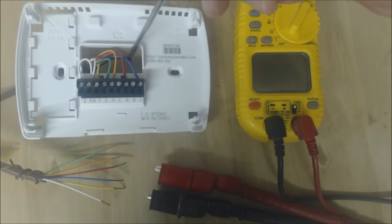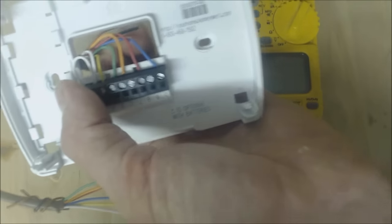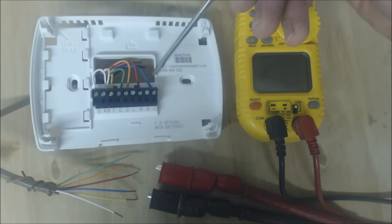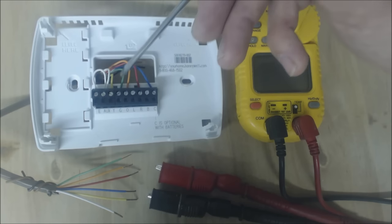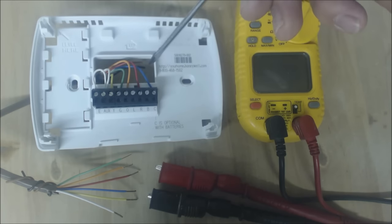You should have an additional two wires — typically you use 18-8 wire for something like this, and you could use wire with even more conductors if you have an outdoor temperature sensor. You always want to make sure you run additional wires to a thermostat just in case one of these wires fails or is touching another one somewhere it's not supposed to. For instance, if the G green wire was touching the C blue wire somewhere in the thermostat wire itself, you could always swap that green wire out with the spare wire at the control board of the indoor unit without having to rerun all new thermostat wire.